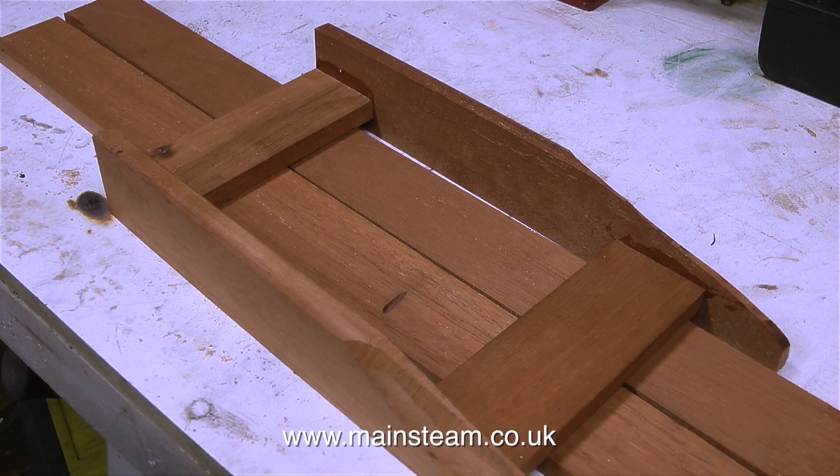So it's onto the tank base. I'm using two longer pieces of mahogany down on the bench to set the correct height for the cross pieces, which in turn are bonded to the two side pieces of wood. These two side pieces have been specially shaped to fit in the bow. I couldn't show the fitting of these shaped pieces into the hull because whichever angle I attempted to film I didn't really get any suitable video — I got plenty of shots of my shoulder though.